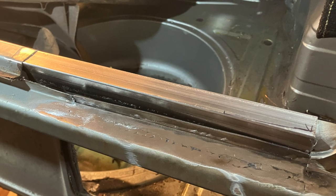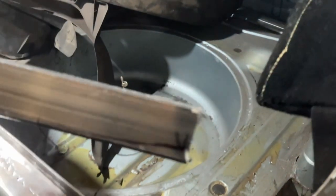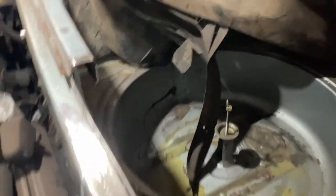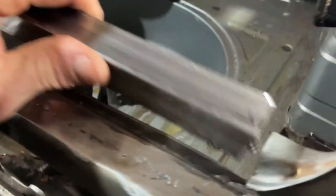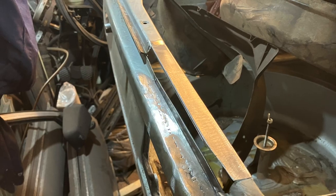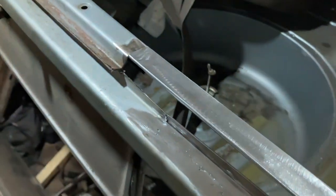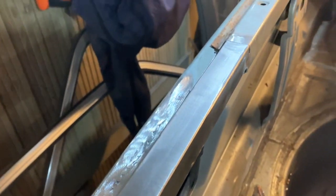The next bit — I used a piece of box section. I cut the bottom and the side out rather than leaving it as box section. If I could have got the right angle I would have just used angle iron, but they didn't have the right size at the steel merchant. This was from B&Q, so I had to sand it all down first — it's got a coating on it to stop it rusting in the shop, so you clean all the coating off otherwise you won't be able to weld it.